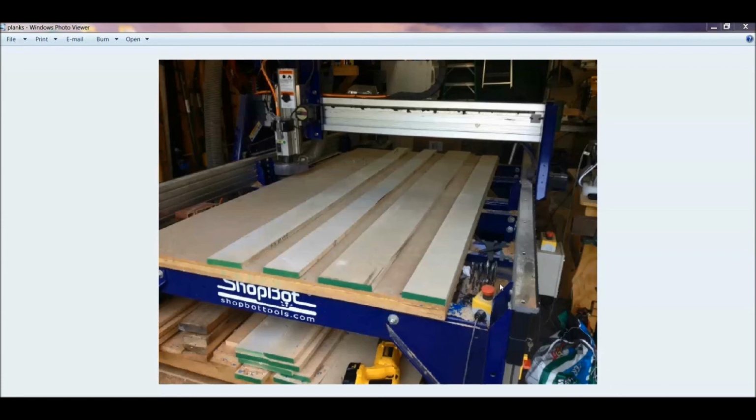You get these planks from your local, this isn't something you get from Home Depot or Lowe's, because you're paying there for the thing to be planed, ripped, and cut to a finished length. These come straight from either a sawmill or a wood distributor, and they're usually planed down to a certain thickness, and they'll have maybe a straight line rip on one of the edges. But as you notice, when you get wood like this, they sell it by the board foot, and it is all different random widths. That's just how this comes. There's a 10-inch one, an 8-inch, a 5.5, 4 3/4.